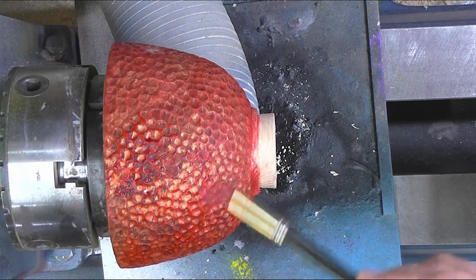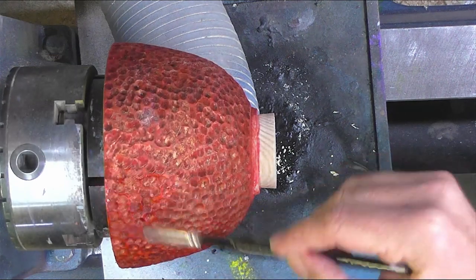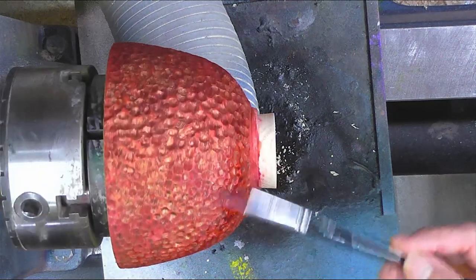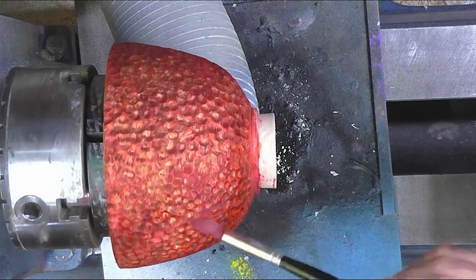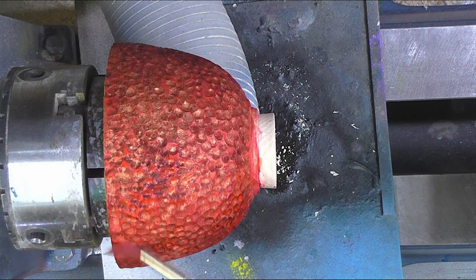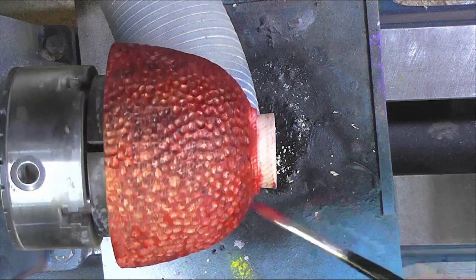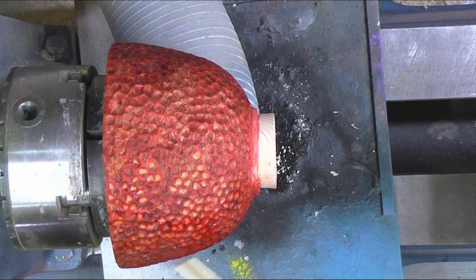See it much better now. You can see how it was catching on the top, not going down into there. I could stipple into it, but I don't particularly want to cover everything up and make it all uniform — that's anathema to me. In terms of finishing all this, I could spray lacquer into it, but I find often with lacquer where there is a lot of texture you can sometimes build up in that texture and I don't like that — it loses something. So I'm going to experiment with a wax finish on this one. I don't mind it being darker and more filled in at the bottom — that's going to be in shadow when it's finished anyway. But this is putting back a lot of the richness of the red, which is what I really want.